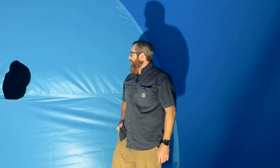All right, we're back inside the test dome. We've got the first profiles done. We did 1 and 2 inches, which is probably relative to half build pressure, and then we did 1 to 4 inches of pressure, which replicates the pressure the building will actually be under. And so now we're going to cut this baffle out.